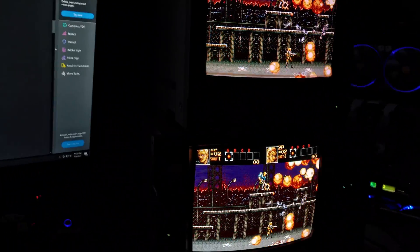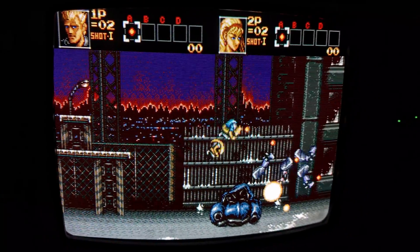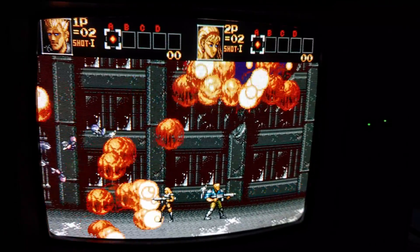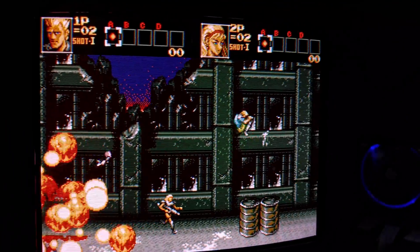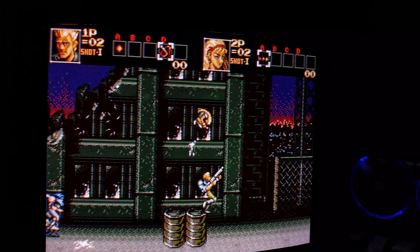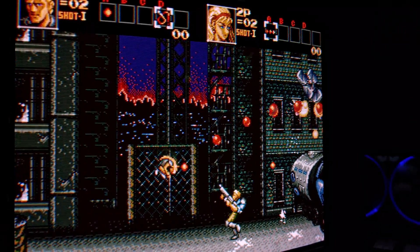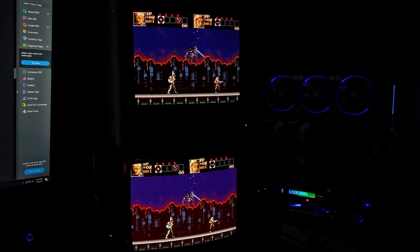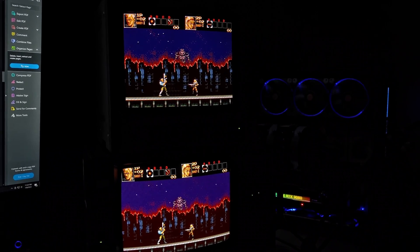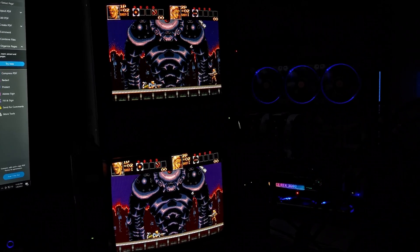I'm going to leave you with footage of the Ikegami on the bottom and this Sony PVM on top after setting the convergence. I'm done messing with this 1344Q for now. I have a PVM 1341 I'm recapping at the moment, and when I'm done I'm going to take this 1344Q and recap the whole deflection side of the chassis board and the power circuit board, then come back and reset the geometry and probably mess with the convergence again. That's going to wrap this one up — as always, don't forget to like and subscribe.